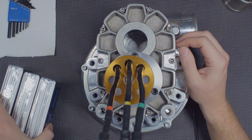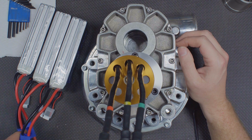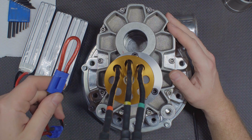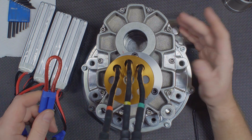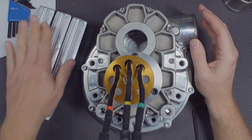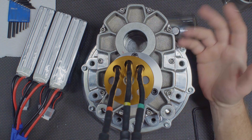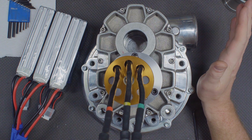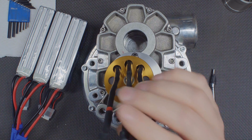One concern regarding the power issue is these 10-gauge cables — the batteries got uncomfortably warm, so that's something we have to resolve. I hinted at this little loop in the battery cable connection. I've got another battery coming because I had a feeling there would be voltage drop, and there was considerable voltage drop. We started at 46 volts — worth noting I did not actually charge these batteries, they were at storage charge, which is why we got 46 volts instead of just over 50. The cell balance is unbelievably perfect, within one one-hundredth of a volt.